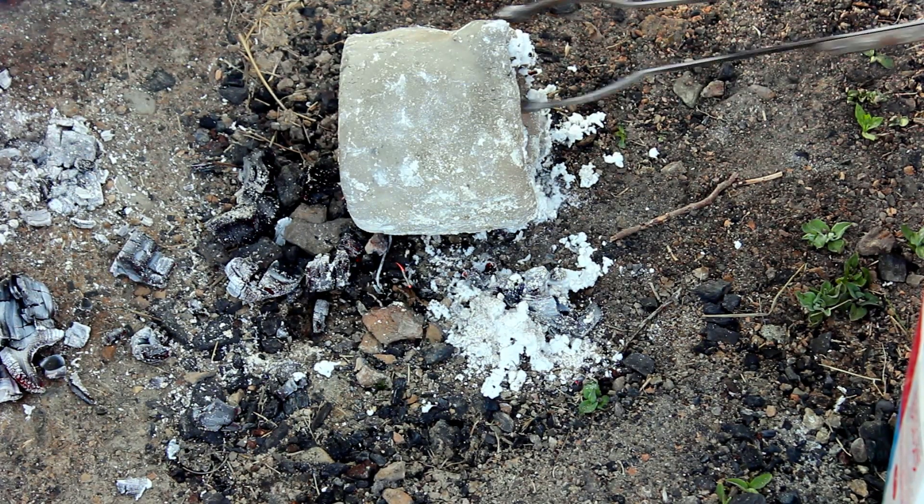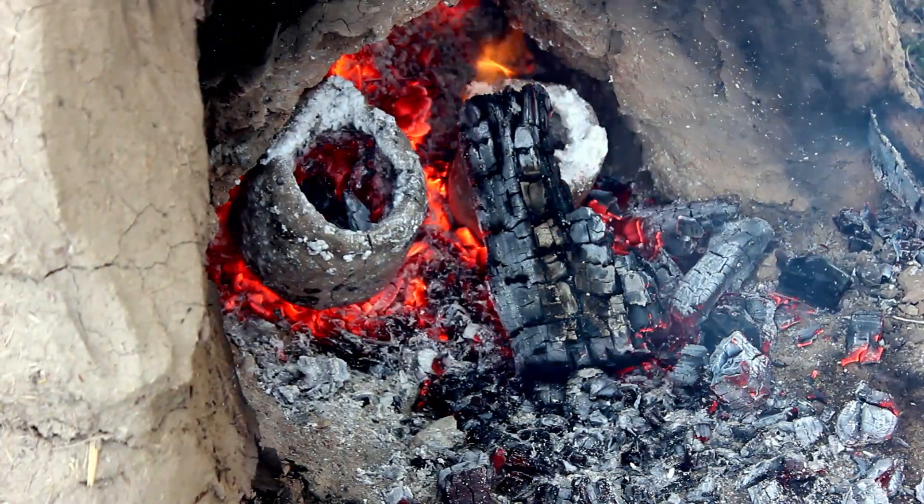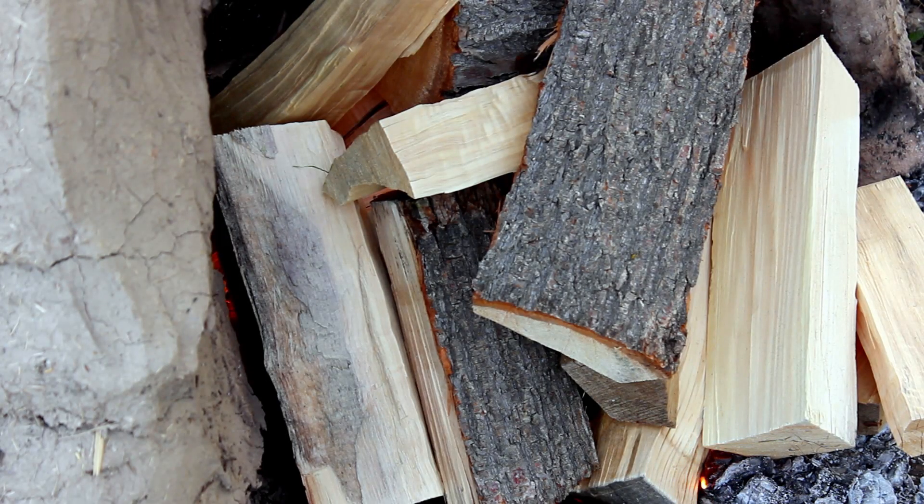All the same, I figured I should keep going and just see what happens. I applied two layers of borax to the inside of each crucible, put them back on the fire to bring them back up to heat, and then I waited for the fire to die down before pulling them out to evaluate the results.